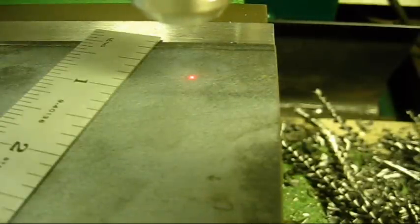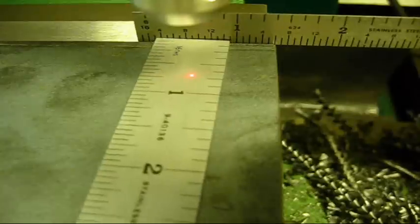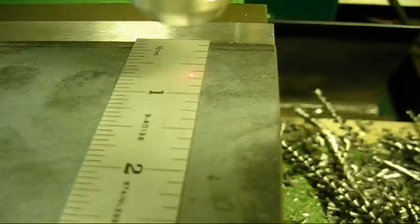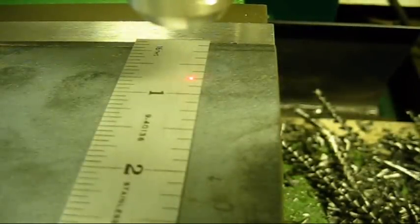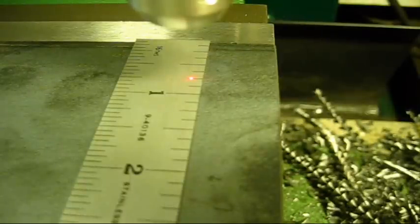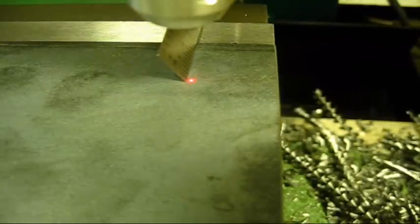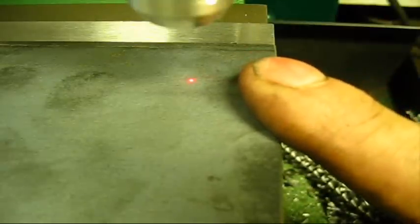From this edge right here to the beam of light also needs to be three quarters of an inch. If you line that ruler up with the edge of the metal, you can move the table this way and repeat the procedure — right down to where that beam of light is exactly in the center of the three quarter inch mark on the scale, and lock the table down. The table won't move in any position. The center will be three quarters of an inch from this edge and three quarters from that edge. As long as this piece of metal is lined up with that fixed jaw, you can drill that position time and time again.